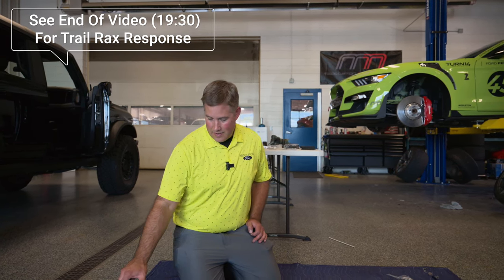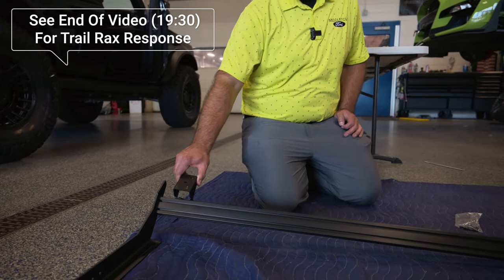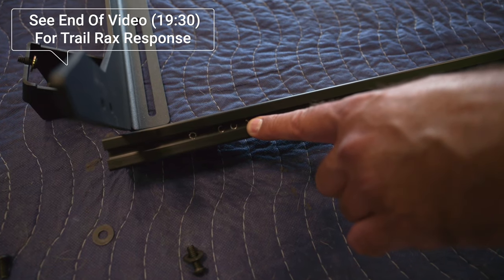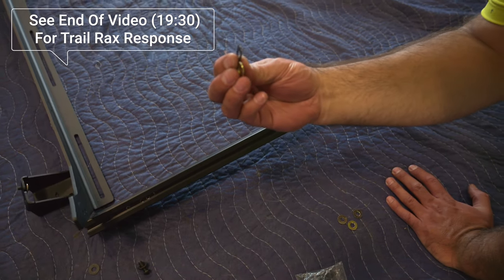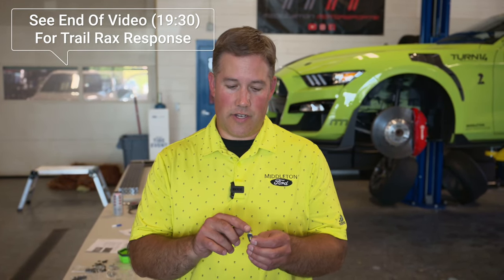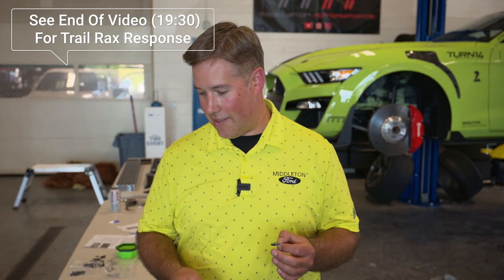We ran into one more issue here. These brackets, after we centered them, we took it off to fully tighten them and they're still loose. We found out these bolts were actually bottoming out — you can see the bolts were bottoming out in this rail, so they wouldn't fully tighten, and that's why the brackets were still loose. We went ahead and found some thicker washers — they might be just slightly thicker enough to make it tighten all the way down. Just to recap: we had to shave one T-slot nut on each bracket down for the front mount because they were hitting each other, and then the bolts were too long and bottoming out in the rails, so we had to use a thicker washer so it wouldn't bottom out and would actually tighten properly.